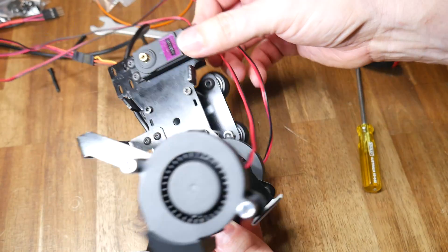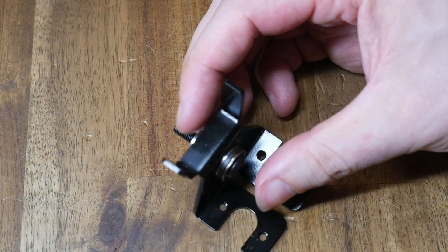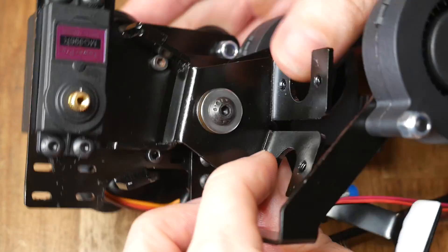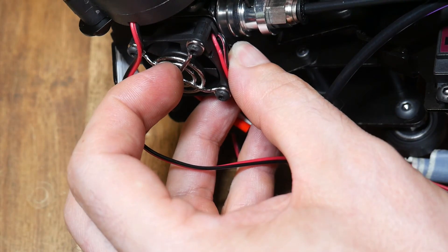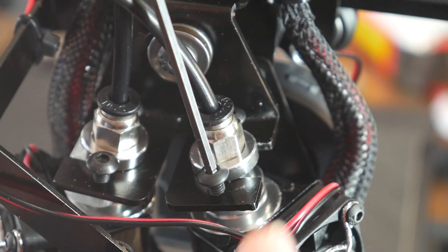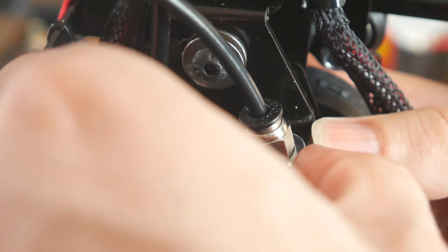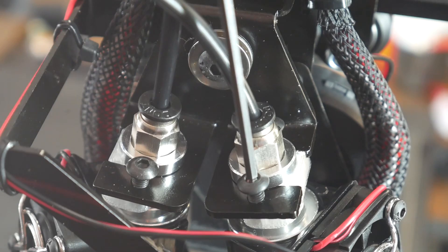I was starting to make progress with the assembly. Next, we have a pivoting bracket that holds the two hot ends, which swivels on a thrust bearing and bolts to the main bracket. The hole seems fairly accessible, but I fumbled for quite a while trying to get the washer and lock nut through the inside. Eventually I got it, rewarded with a satisfying mechanism. Sliding the two hot ends into the openings was also incredibly fiddly. One thing I really don't like is the way two bolts are meant to retain the hot end — as you tighten them, they twist and try to push it out of position. My solution was to design and print a simple mounting adapter that slots onto the top of the groove mount, so when you tighten the bolts they line up with the holes underneath, preventing the hot end from moving.